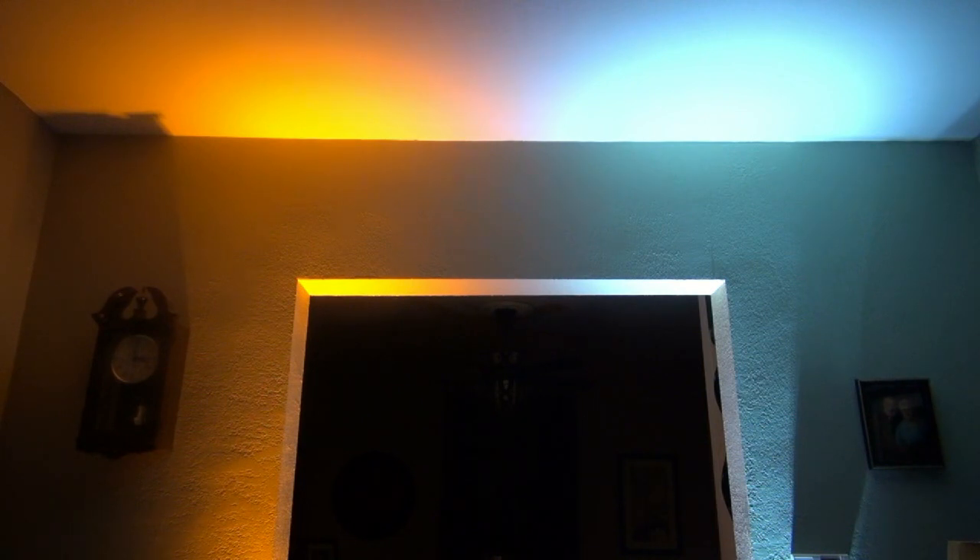Let's focus on the QWH5 for a minute. Although you cannot produce a better amber than you can with an amber LED, you can kind of produce an amber using red and green if you have tri or quad LEDs — they mix well that way. Regular RGB LEDs don't do so well, but with a quad or a tri you can definitely do it. All you have to do is give yourself full-on red and then add green until you have the amber you like.